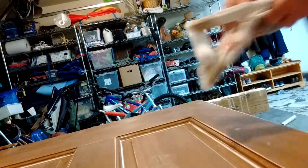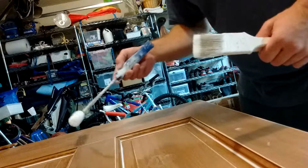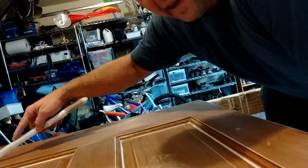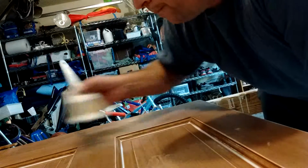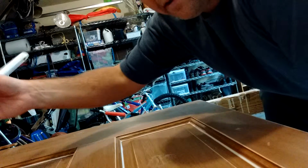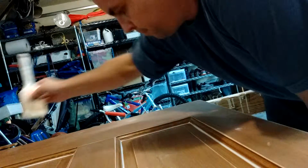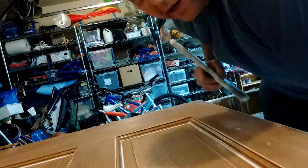Okay, now looking toward the back of the door, finally I'll roll this part on. This takes about one brush load, or one roller load down here. You tip that off the same way. And once again, any paint that gets on these outside rails here from that painting, either here or further up the door, you want to just come by and give it a light little sweep to at least get the brush strokes going the right direction.